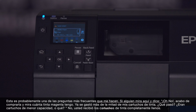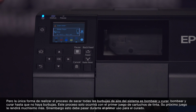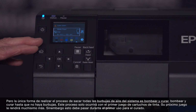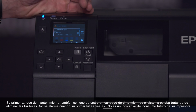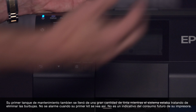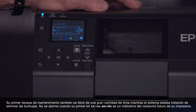No. We ship with full ink cartridges, but the process of getting all the air bubbles out of the system, the only way to do it is pump and prime, pump and prime, pump and prime, until we come up without any bubbles. This is a phenomenon that will only happen on the first set of ink cartridges. The next set will last massively longer, but this is what we have to get through the first time to prime it. And that first maintenance box obviously took a fair amount of ink, because we were cycling ink through trying to get rid of those bubbles. So don't be alarmed when the first set looks like this. This is not indicative of the usage you're going to be getting out of your printer.